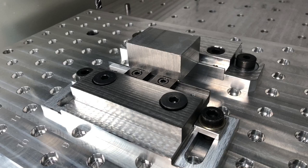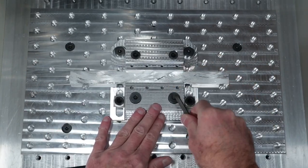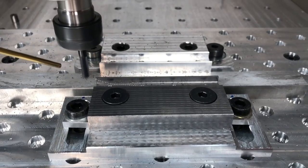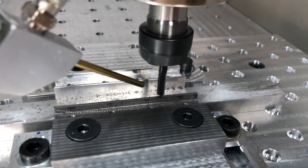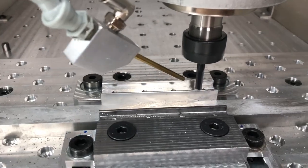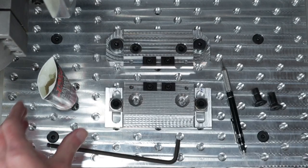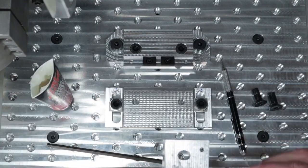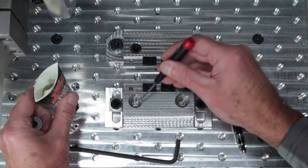One thing is still open. The part rests highlighted here with the arrow have not been machined in the same setting — one was machined in one setting and the next, because of stack tolerance, is sitting at a different height. So I went over to the aluminum part, picked up that dimension, subtracted 0.1 millimeters in Z, and then machined both surfaces one more time over. That gives me a precise parallel seating of the part onto the part rest.